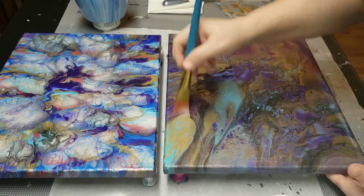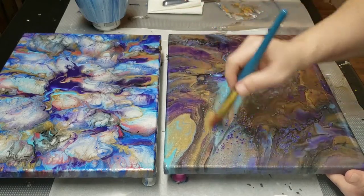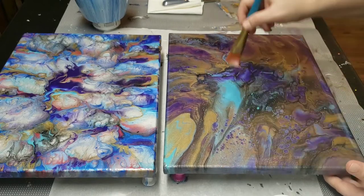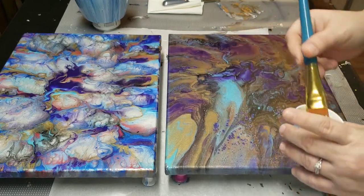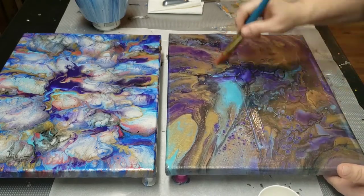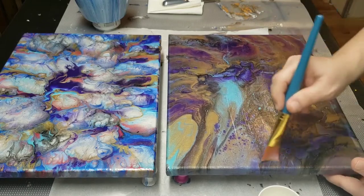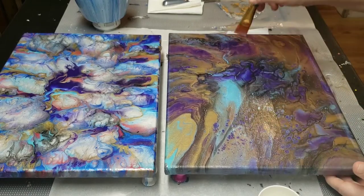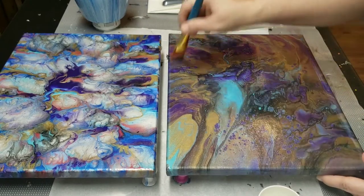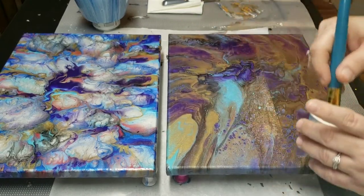It's always best to do as long strokes as you can — it's well documented out there — to try and eliminate any brush strokes. You're going to be going through these layers at least another two times; you should do two to three coats. I felt it a little tacky there, so I have to leave that area alone.